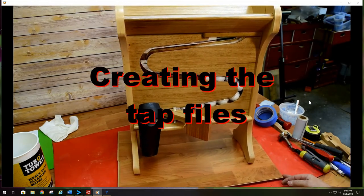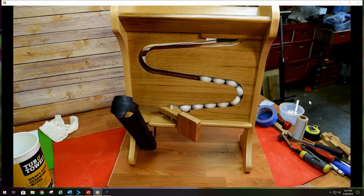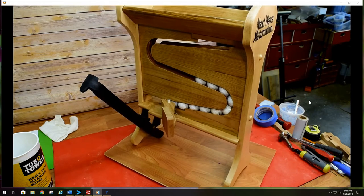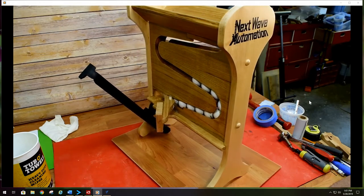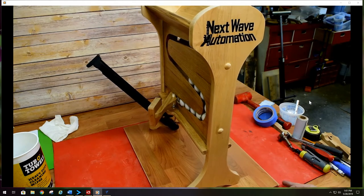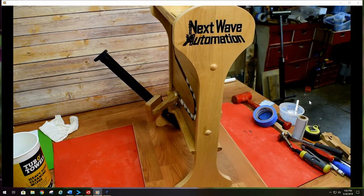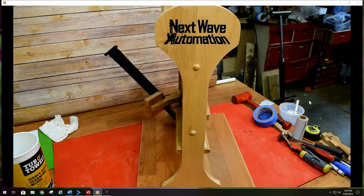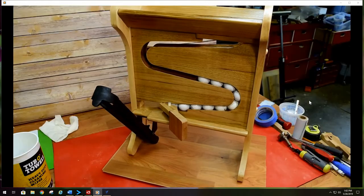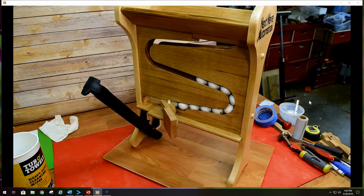The tool paths are currently set with tool, feeds, and speeds that were used in designing the original project. Be sure to review them for your machine. Edit the tools and change the settings to fit your own machine and requirements. It is very important to recalculate all tool paths after making any changes.